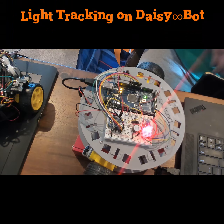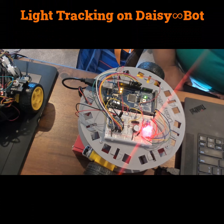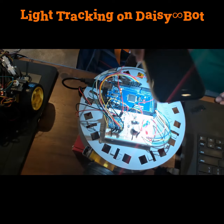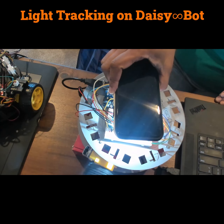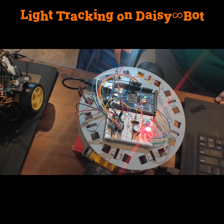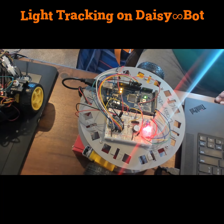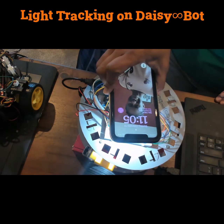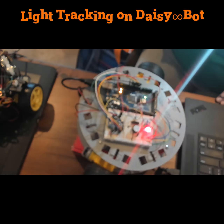Flipping the switch, and nothing happens because it does not detect more light than the ambient. So if I use my cell phone light, the more light, the faster the robot goes, and as I take the light away, the robot slows down. If I take it totally away, it goes back to 0. So the light is proportional to the robot.